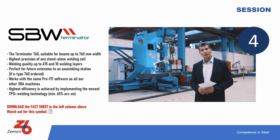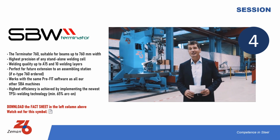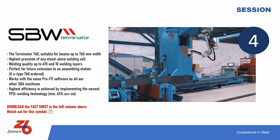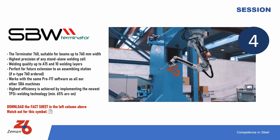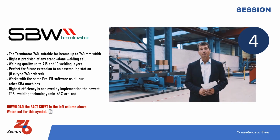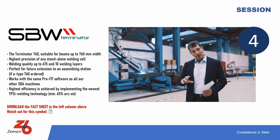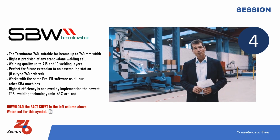There is a big lack of welders, well-experienced welders this time, so that is a good solution, let's say, for the industry. You can see the new welding cell, what we are using is the TPSI Fronius welding cell, and it's 20% faster than our usual welding cells we installed in the past. You see that we put these beams on flippers so we can automatically turn them always in 90 degrees to achieve the best position for weld out.